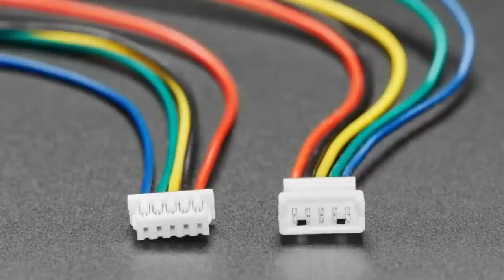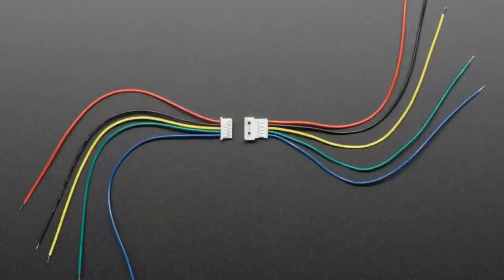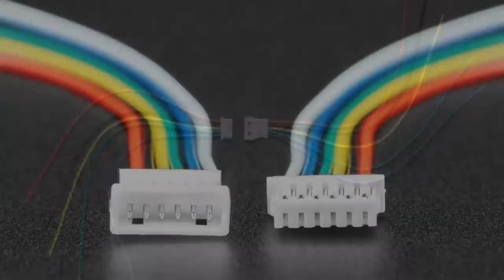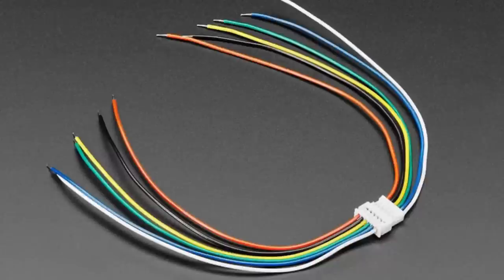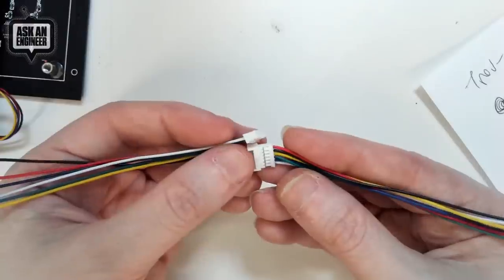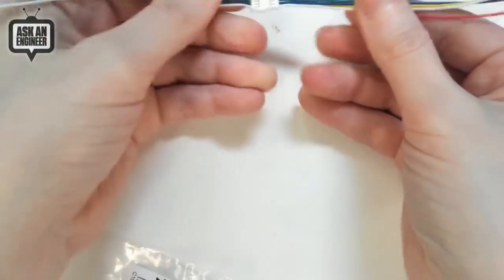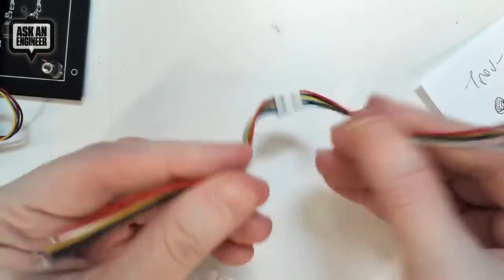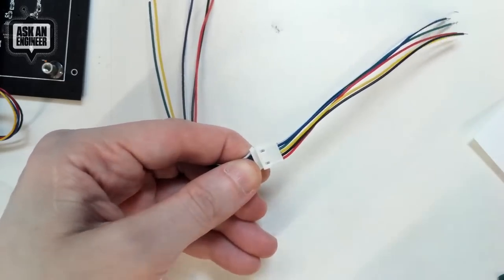Next up, we've got some more Pico blade connectors — we now have 5-pin and 6-pin. These are pigtail pairs: one is a socket connector, one is a plug connector, and you plug them together. These are really compact and thin — more compact than JST SH or XH cables. I think they are 1mm pitch. You can see here they're really small, and they snap together nicely and solidly. The cables are nice and flexy, about 10 centimeters each, so together about 20 centimeters total. We already had 2, 3, and 4-pin versions, and now we've added 5 and 6.